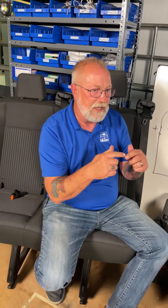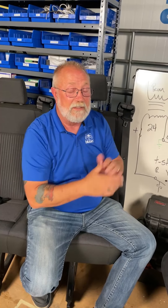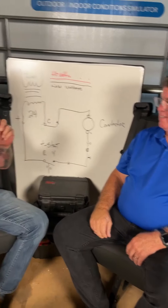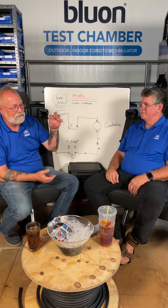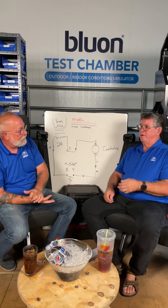If you've got a hike to the condensing unit and can't hear it, and you're going to run it for a while, make sure you turn the fan on — that's R to G — because if you pull the sub base you need the indoor fan running while the compressor runs. All of this is about making sure we don't break a compressor.